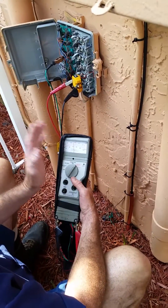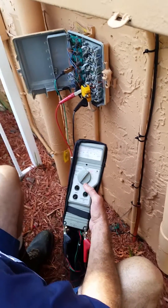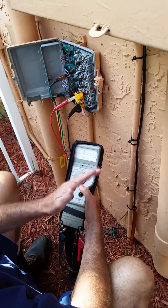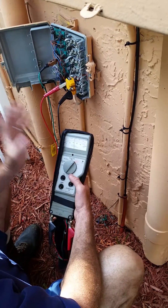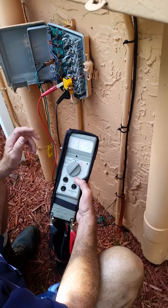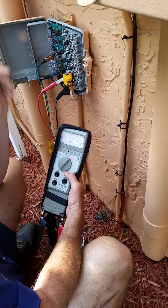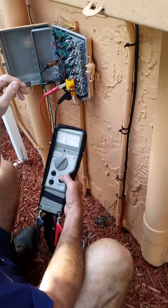With this short on there, it's not a service-affecting short as it stands right here. But what I think is happening is whenever it rains, some moisture is getting into these lines, and that slowly builds and builds until it gets down under 10 ohms. At that point, whenever a customer tries to call in, that extra voltage will short the line.